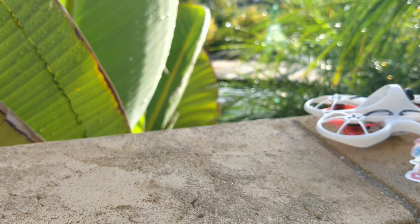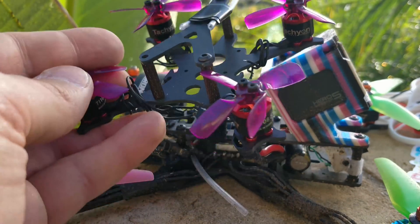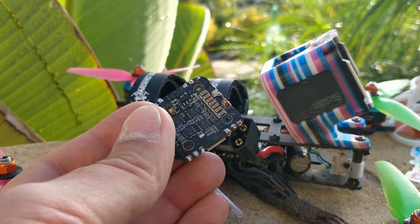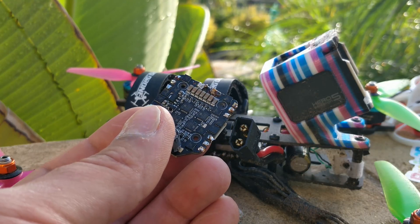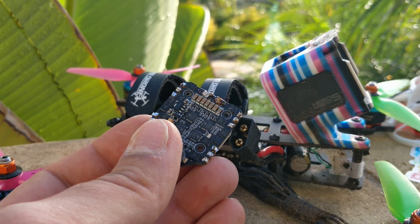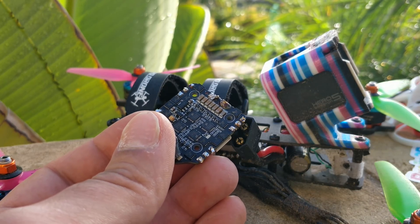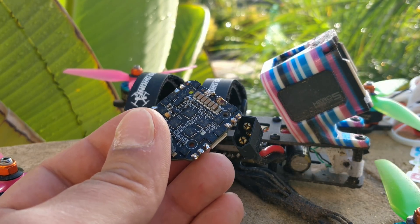This is a new quad that I built. I was using the Emax 6S 20x20 board because I was running 6S. This board is perfectly good for up to 4-inch and a light 5-inch racer — it's totally fine. I wouldn't, however, recommend it on a 5-inch Acro quad just because it performs differently than ESCs with bigger FETs. It will run low KV 6S on 5-inch pretty satisfactorily, but I wouldn't trust it or rely on it.